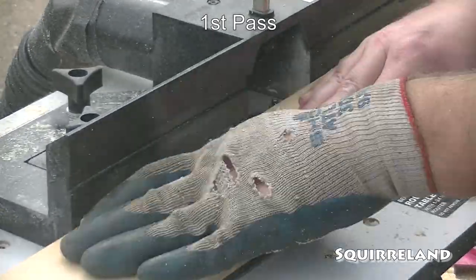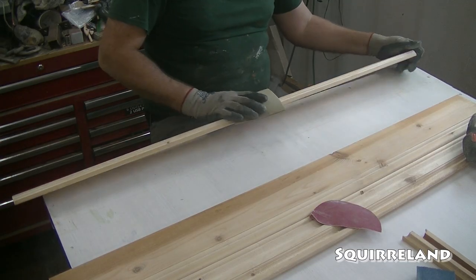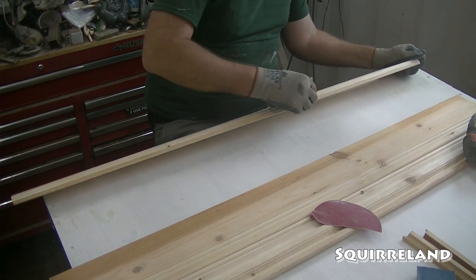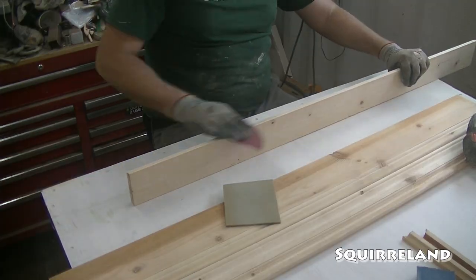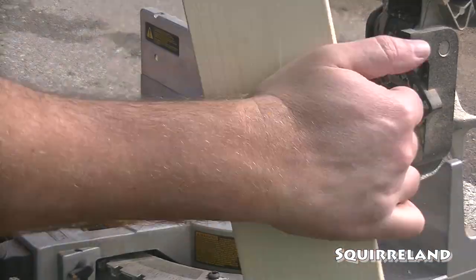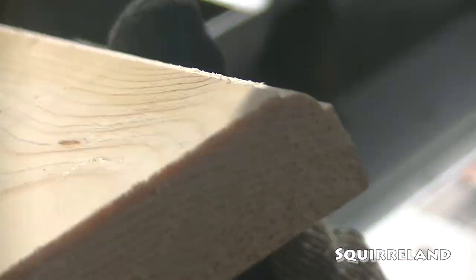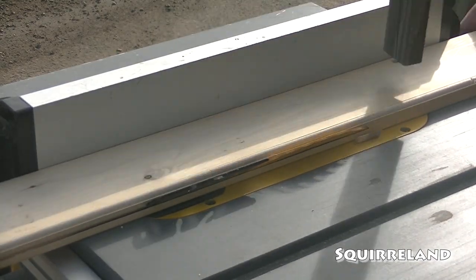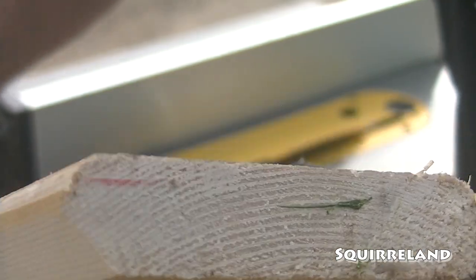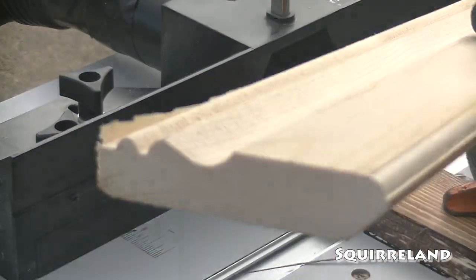The next few boards I'll be making are for the removable portion of the crown molding. This first board is for the back half of the crown molding and will have the bolt holes drilled into it that will allow it to temporarily attach to the panel. This board is the front facing board for the crown molding — I ended up having to run it through the router table several different times with three different router bits to get the look that I was going for, and I needed it to have 45 degree angles on both sides. I also opted to stain the boards individually for the most part to try to minimize the wood stain collecting in between the boards and making a dark line down the length of it.